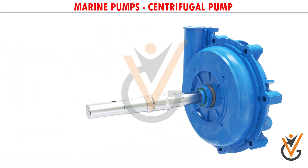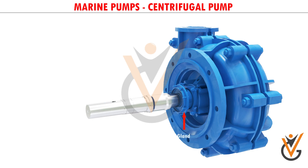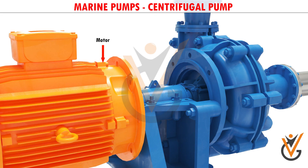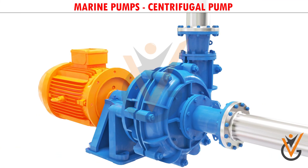A shaft is used to connect the impeller and motor. Since water pressure inside the casing is high, a proper sealing arrangement is imperative to arrest water leakage through the shaft-casing clearance. A stuffing box or mechanical seal-based mechanism is used for this purpose. The impeller is mounted on bearings, but at the suction side it is not advisable to fit a bearing since it would block the flow, so bearings are fitted at the other end. This means the impeller is mounted like a cantilever. For high flow rate pumps, a bearing housing with cooling oil is necessary for improving bearing life.